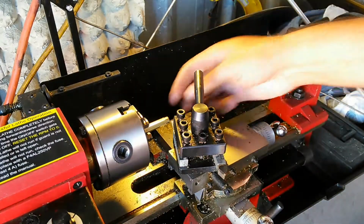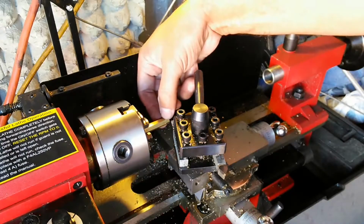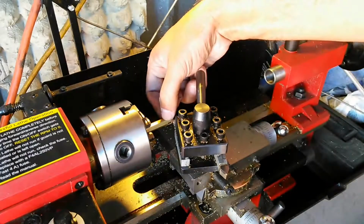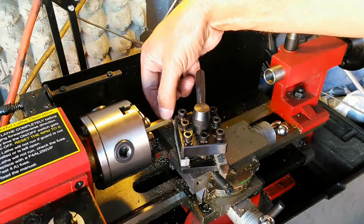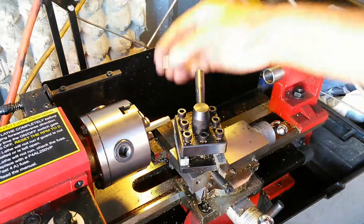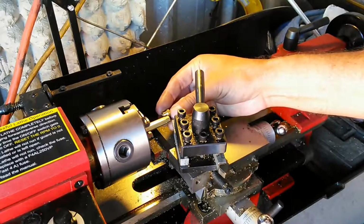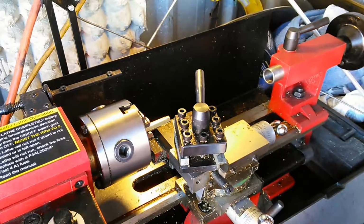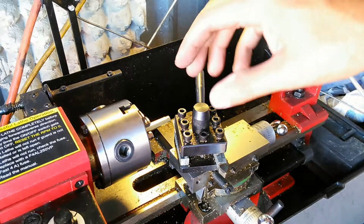As I go further in, this will become more of a bevel there, and this will become more like 240, I think it was, is what I measured it out to be, and that will be 200 thousandths. I want to make sure that I'm consistent here. So yes, I am. That's how I'm going to be doing it. So I'm going to keep cutting it. I probably won't come back on camera until I'm closer to the end of the cut.